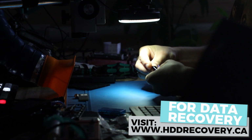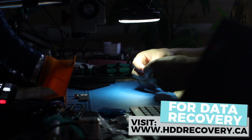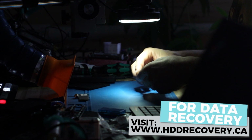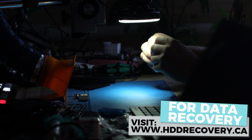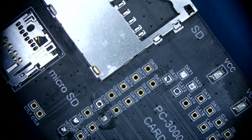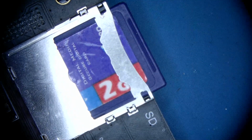Usually this is not something new for devices similar to this. No brand names often do resort to these kinds of builds, but let's test the card out because I haven't really played around with it yet. Best thing would be to check the interface and see what comes back from the controller communication. So for that I use PC3000 together with the adapter for the cards, and here we can plug in the card directly into the socket.